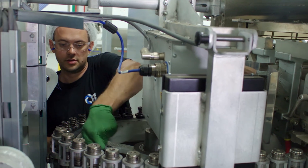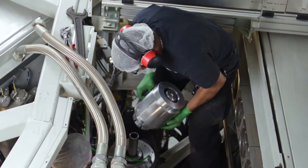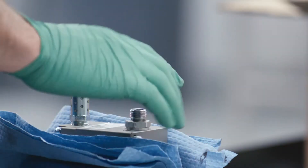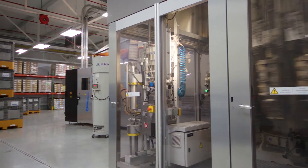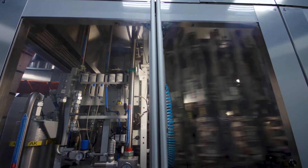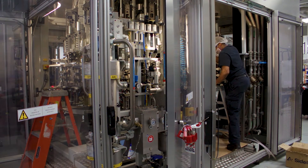Tasks were then assigned to the individual technician by the crew lead and the crew themselves. The first order of business when arriving on site is to review the area for potential hazards and review the machine. We'll also identify energy sources and ways to isolate those energy sources so that the work can be performed safely.